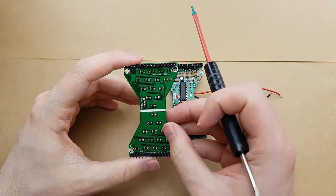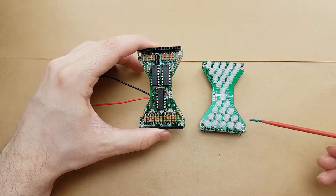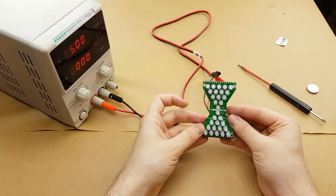Originally I thought that the square pin was going to be negative. As it turned out, the square pin was actually positive for all of the LEDs and the circle was negative. Had I paid attention to the silkscreen, I could have seen that there's a flat side on the silkscreen for each of the LEDs and that's where the flat side of the LED should go — the LED's flat side is negative. The holes are marked A and B so you know which direction to connect them. It did work with the LEDs in backwards — you just had to flip the hourglass around — but the animation was backwards instead of forwards.